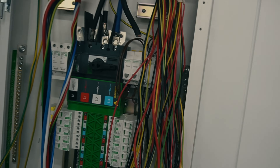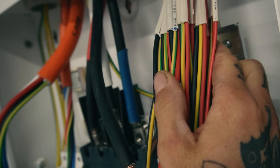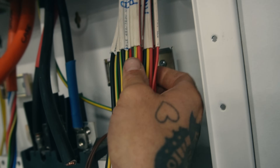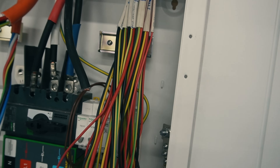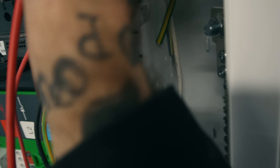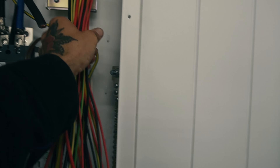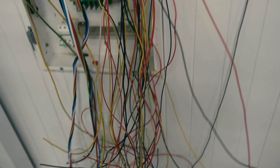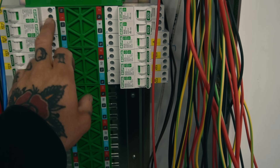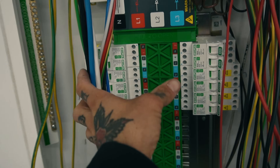Now I'm going to do all these - I'm just going to make a mark where I want and get them all stripped to the same length, keep it all neat. Now we're fully stripped out. See how I was saying - with these cables you can see the red line, so I know all my reds are on this side. So I'll group all my reds together, pull them out, all my earths and all my neutrals. That's what gives you a really nice clean look, especially when everything's cut to the same line. The next thing I'll do is label the ends - two, four, six, eight, ten, twelve on this side, and one, three, five, seven, nine on this side. Say this is my number two - the neutral will be labeled two, the earth labeled two, and the active labeled two.